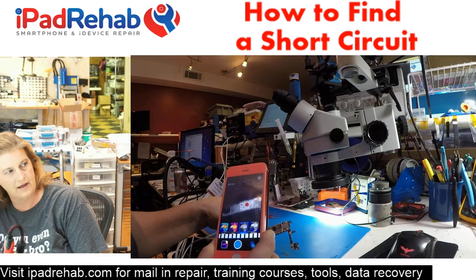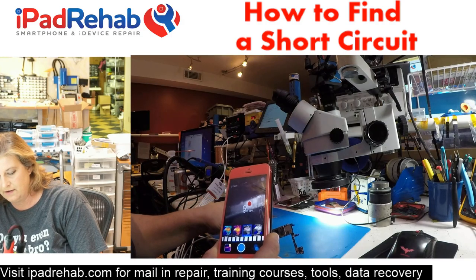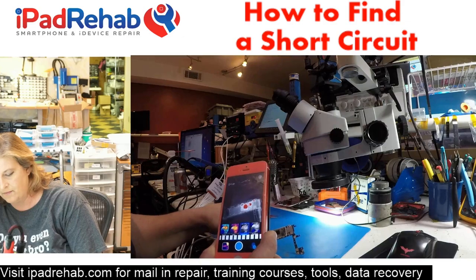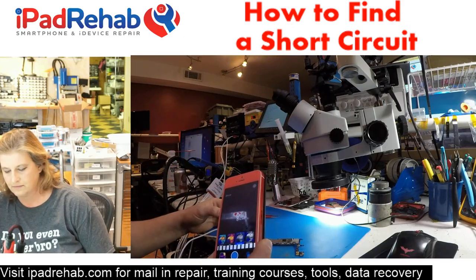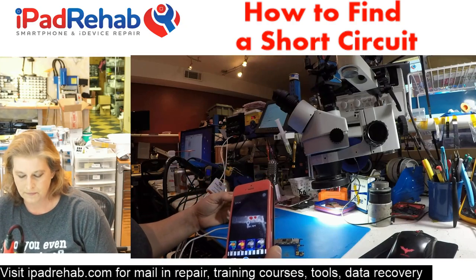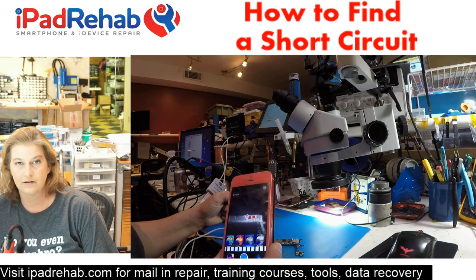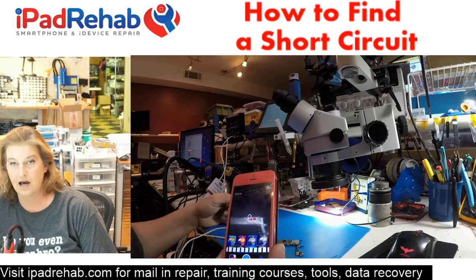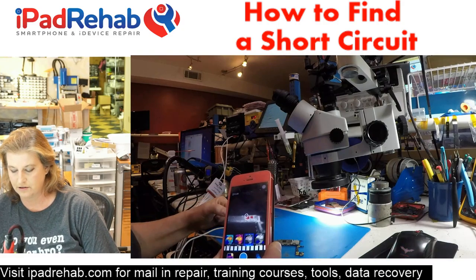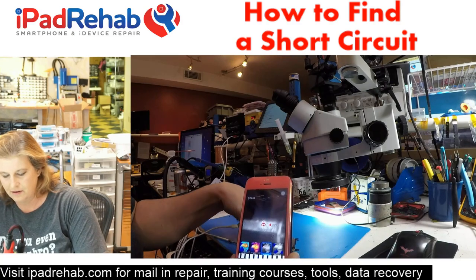Okay, so on the back of the board, it is clearly showing heat on the PMIC. That's this chip right here. All right, let's turn that off and try again. So now we don't know which one is first. Does the PMIC get hot first on the back of the board, or does this top corner get hot first? That's really hard to tell.